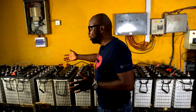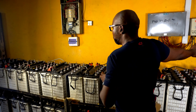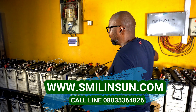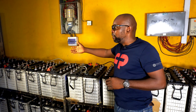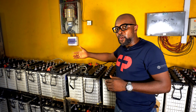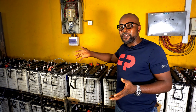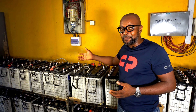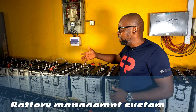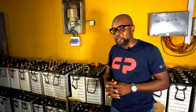The connections are going to be done in series — from one end of the battery terminal to the other end, everything connected in series. But because you have a large number of batteries, what you are also required to have is a battery management system, an equalizer, that will ensure all the batteries are receiving the same equal amount of charge.